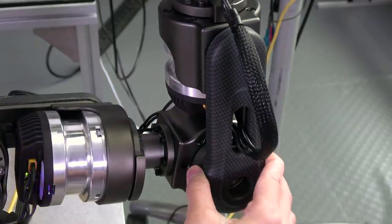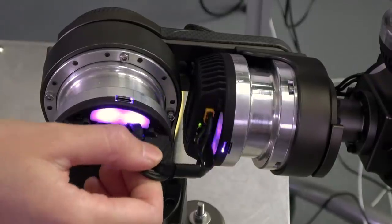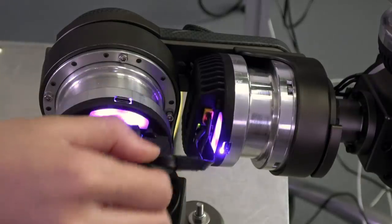That's the software. The build quality on the arm is nuts. All metal, it's got these little cosmetic covers that pop on and off, but those can be 3D printed if you want to replace them. Each servo on the arm has an easy to replace wiring harness running to the next servo, so if anything breaks or they catch on something, you aren't looking for some weird proprietary connectors, those are easy to swap out. If anything, the arm is overbuilt. I can't imagine anyone having any complaints about this hardware for the price.